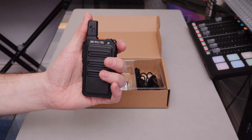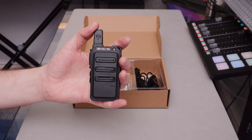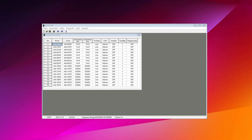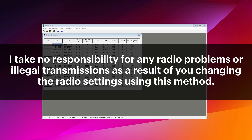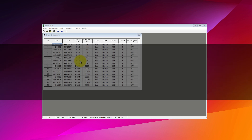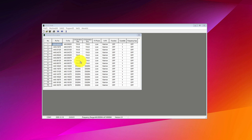Very stubby. If I put them in my hand, you can see there's not much to them at all. Some of you will be wondering whether you can change the RT619 and RT19 from low power to high power. PMR446 radios are legally bound to not transmit more than 0.5 of a watt. These radios work in different regions, so they are capable of 2 watts usually — though that's asking a bit much for a 1300 milliamp hour battery. But yes, you can do that.